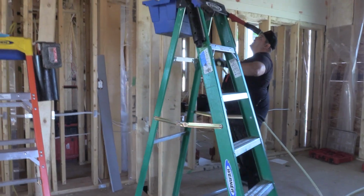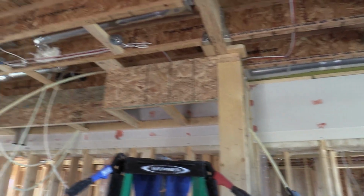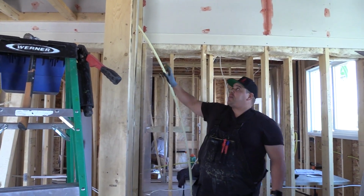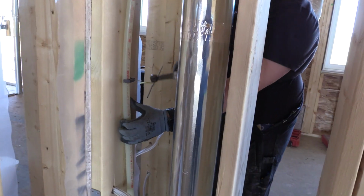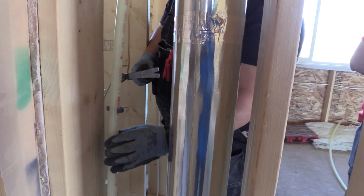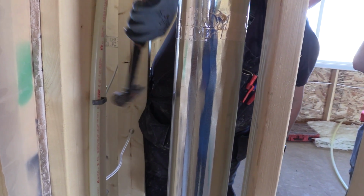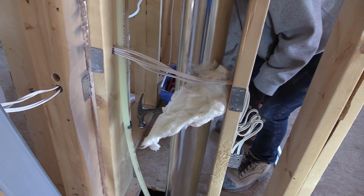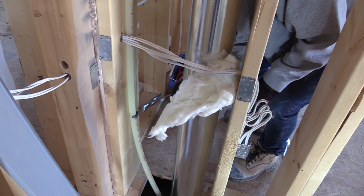We're gonna probably be on this side of the joist. We're gonna run our 3/4, something like that. You got lots of room. You can do a nice sweep there. Just run it back. Just run it through here. So instead of sitting here and trying to do this, take the J-clip out, clip it on, angle it like that, and then just tap this over. And just give it back, keep going. There you go.